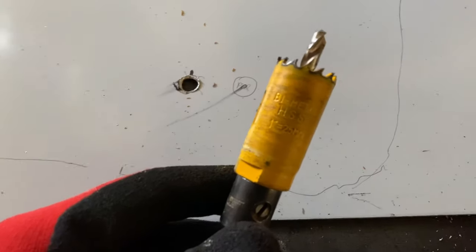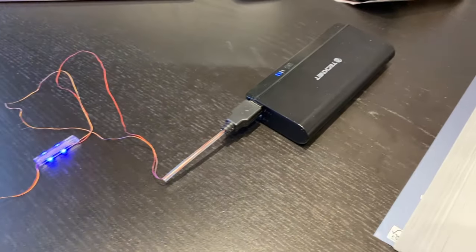I used a nine millimetre drill bit and a 25 millimetre hole saw for the USB power port — otherwise the cable will hang down below the model. If you're mounting to a proper wall, you'll need raw plugs and some screws. If it's to plasterboard, obviously use plasterboard fixings. It's pretty standard building stuff for a UK normal wall.